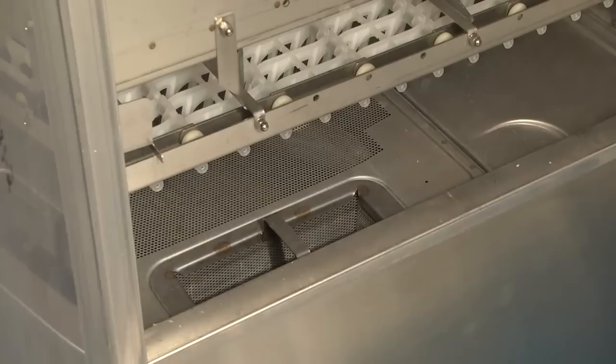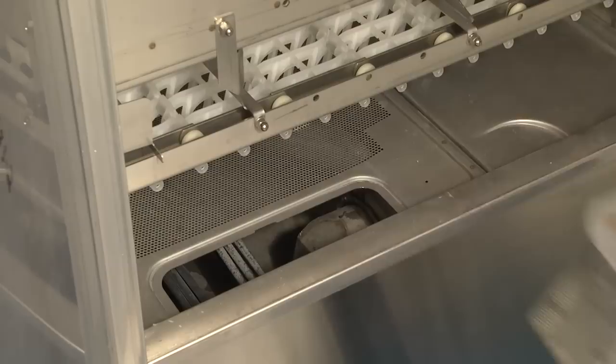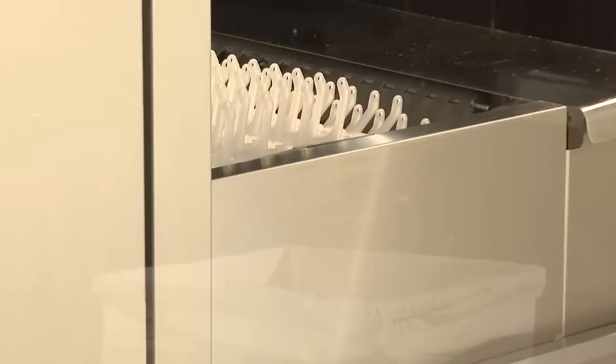During machine operation, the strainer baskets can fill with food soil and affect dishwasher operation. The baskets must be emptied periodically. Stop the machine and open the access doors. Strainers are located immediately inside of the tanks toward the front. The external scrap basket at the load section should also be emptied periodically as needed and can be done without interrupting machine operation. When required, remove and empty the scrap basket and replace when done.